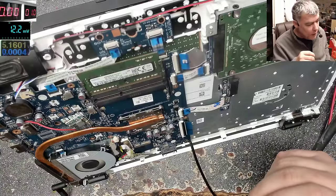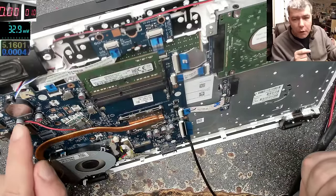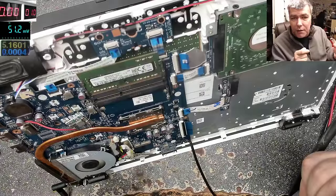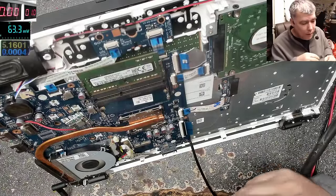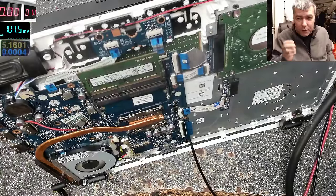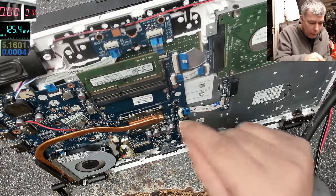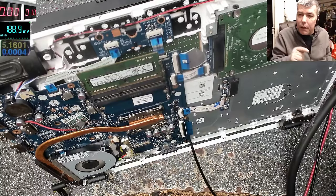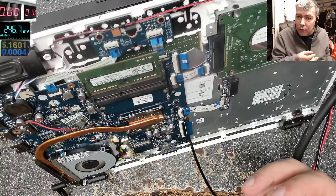I'm not really scared of freezing. Now the other question we can have is how do we know the 5 volts power supply will support the extra current, which is nearly 1 amp. I remember 700 and something milliamps. When you build a power supply, how much current do I need? I need 1 amp, okay, I'll build a power supply for 2 amps, just to be sure it's running colder, yeah?